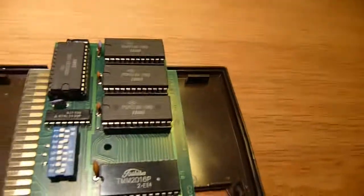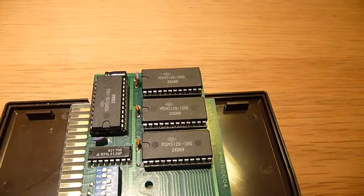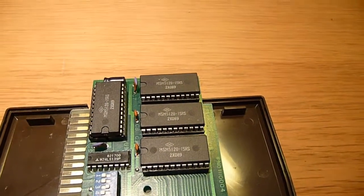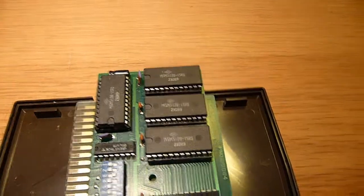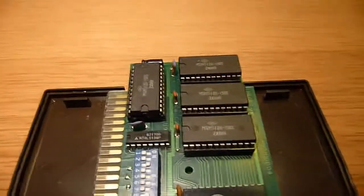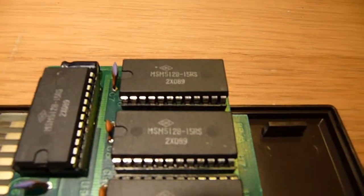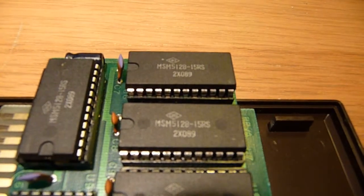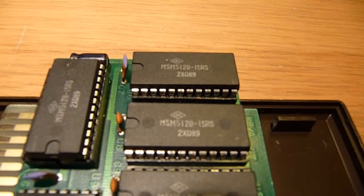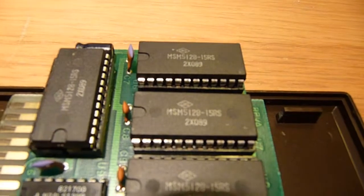What's the fancy thing about that, you might ask? Well, it's actually where you can store your programs and stuff inside. The functional block diagram tells me that it has a row select, memory array of 128 rows, 16 columns, and 8 blocks. Yeah, that kind of makes pretty much sense.